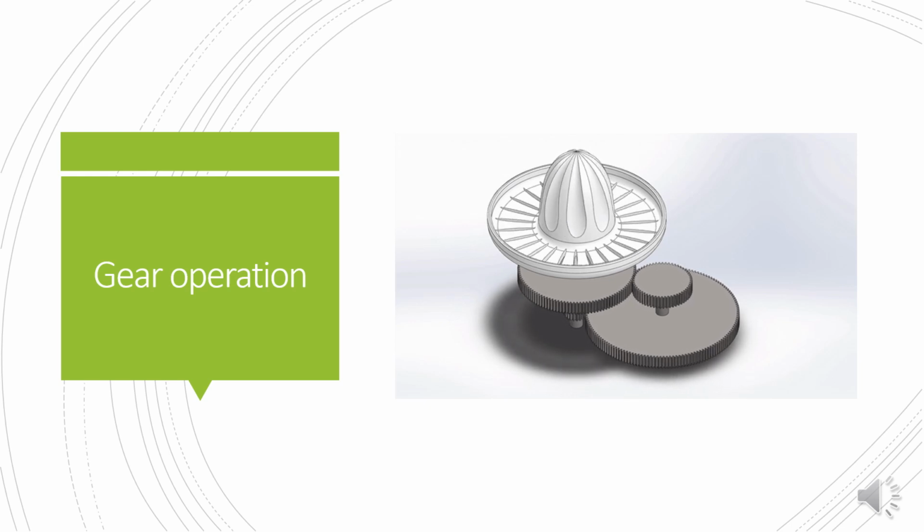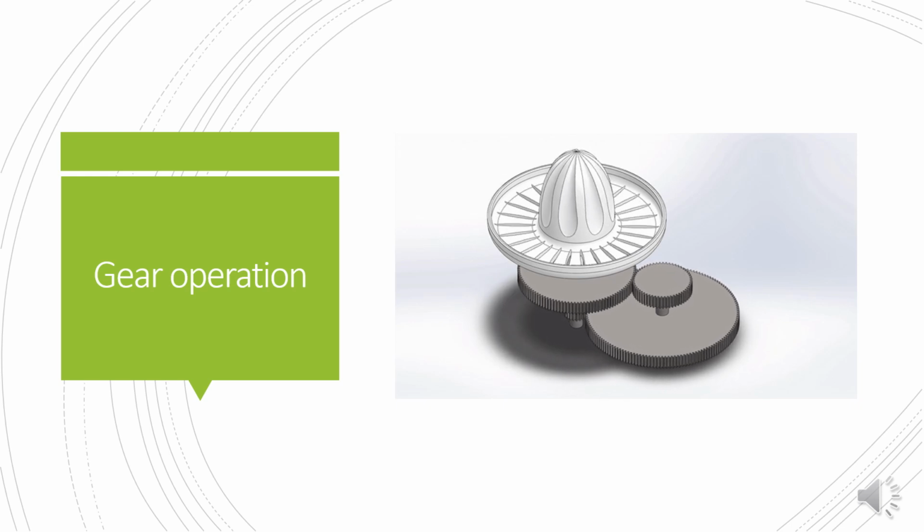In order for this to be accomplished, we had to implement a dual-stage speed reduction. This is because if a single pair of gears was used, then the gears would have to be unreasonably sized. The implementation of this coaxial gear train allowed for two-stage reduction and therefore smaller components being able to fit in a countertop fruit juicer for the household.